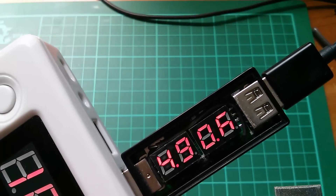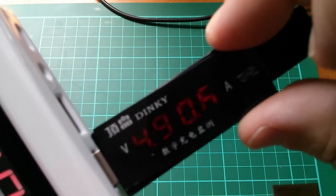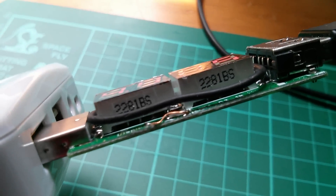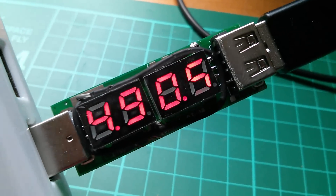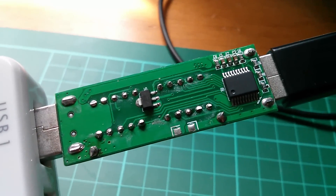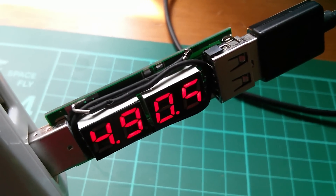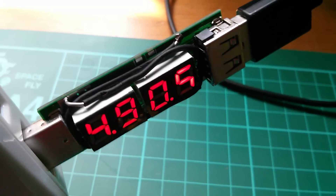Also I've noticed that although those digits are reasonably bright, when you put the display cover on it almost completely masks them out. This is a bit rubbish. Here's the thing out of its little box — there's a wiring bodge mod near that potentiometer. The current sense resistor is that loop of wire wrapped right around the displays. The soldering on the bottom doesn't look so bad that it would cause a digit to fail, so it's possible the LED block itself is faulty. I'll touch all those joints with an iron to see if I can restore it, but I'm not very pleased with how dim these segments are, particularly when the cover's on.